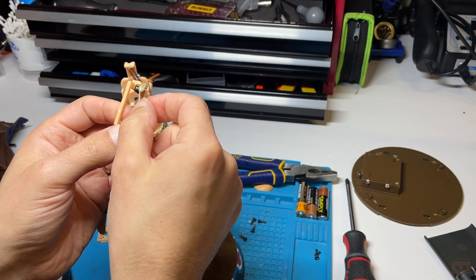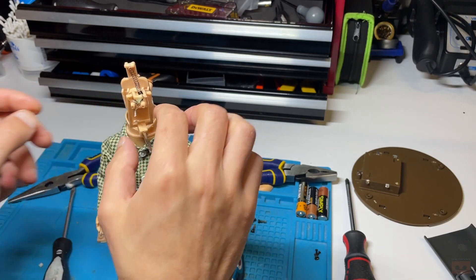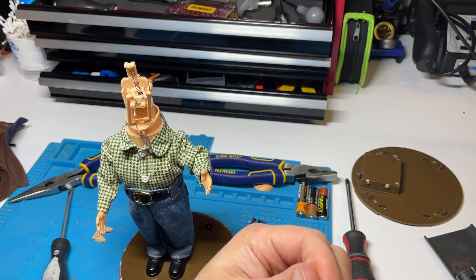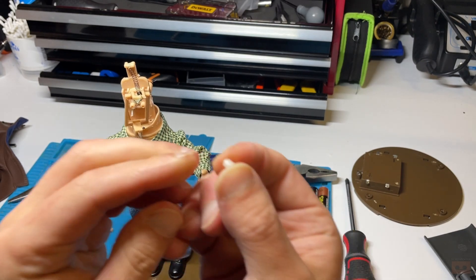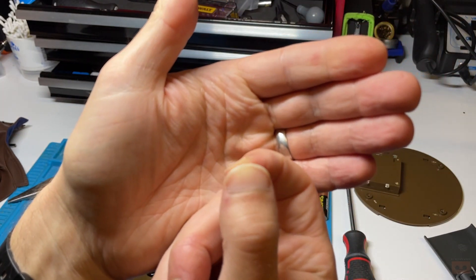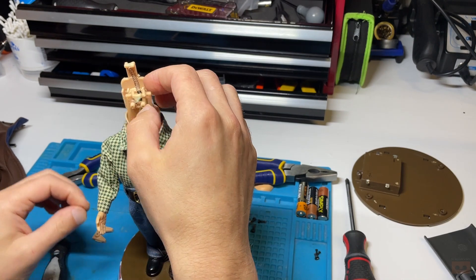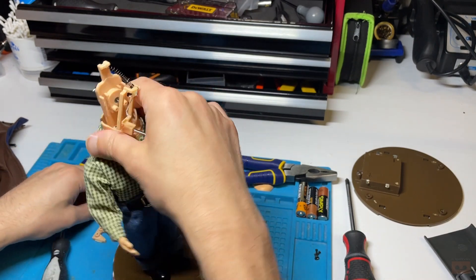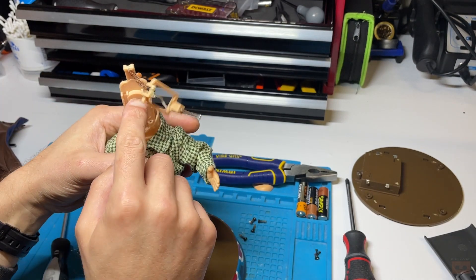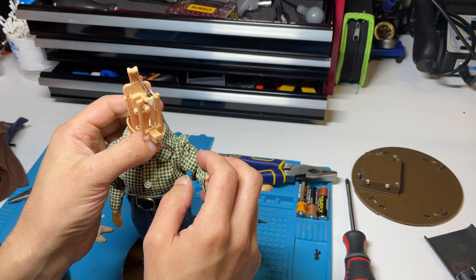Has someone tried to fix this in the past? It's all very glued. This bit was already broken - you can see this little plastic piece has a crack through it. What I need to do is re-solder this back on and then see if this is turning. But that won't help us with why the head isn't moving either, so I'll have to check that mechanism out.